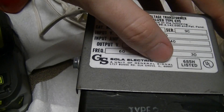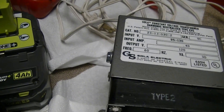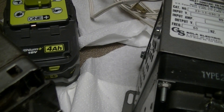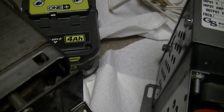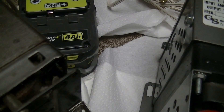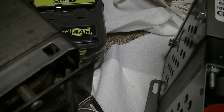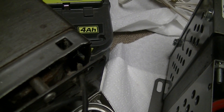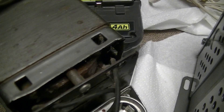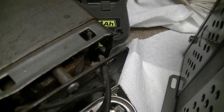This one is 120 volts. I've got some early 1950s fluorescent choke ballasts for F20T12 lamps that say 118 volts, and I recall a 1980s cash register at a convenience store that said 117 volts. There are all kinds of historical variations, and loads of people still refer to mains as 110 volts, which it hasn't been in close to a hundred years.